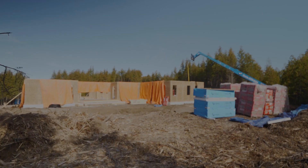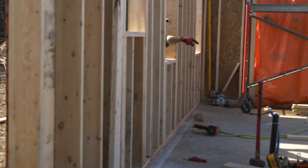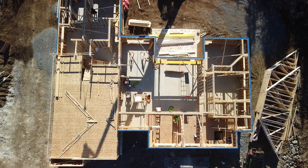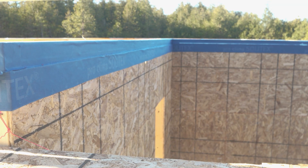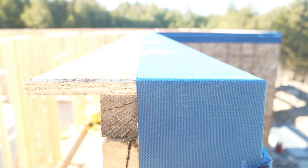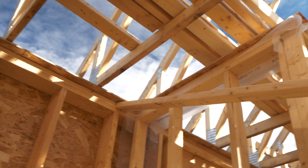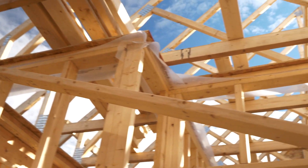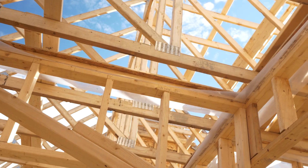This is where the air sealing details are important with the framing. Where the framed walls meet the foundation, the team will be sealing this with an adhesive caulk as the air barrier. At the top of the walls, the team used a permeable peel and stick membrane that laps over a piece of OSB. The OSB will be covering the entire underside of the trusses and will be the air and vapor barrier once the joints are taped.